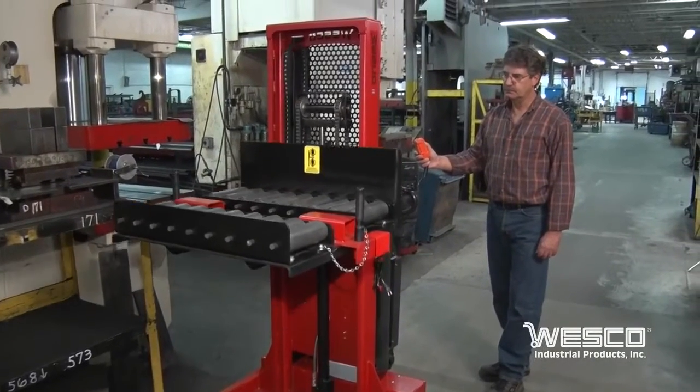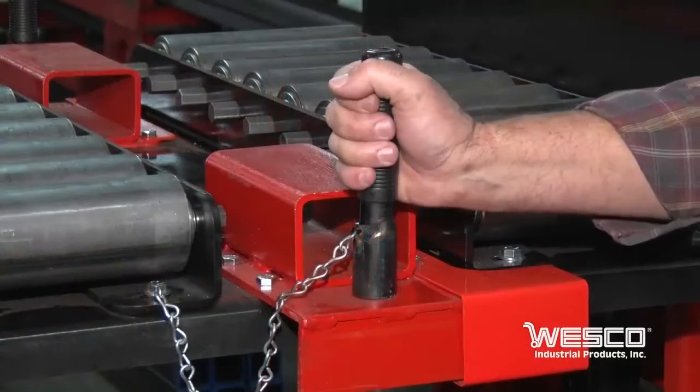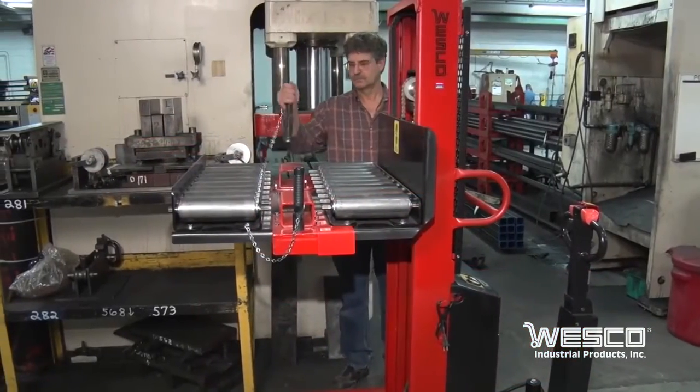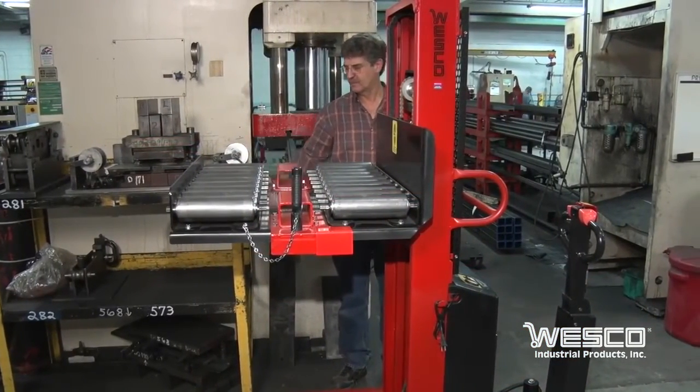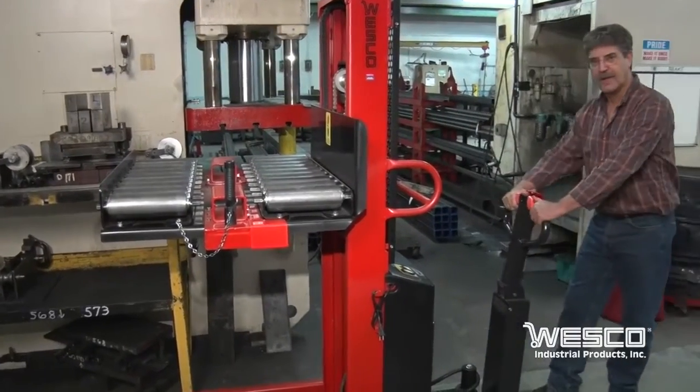This particular model was designed with safety rail stops to prevent carriage travel beyond 50 inches at the top of the rollers. In addition, removable stop pins must be in place in order to move the stacker. The pins ensure that the die will not fall off during transport.